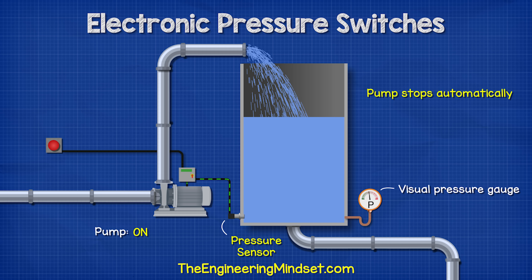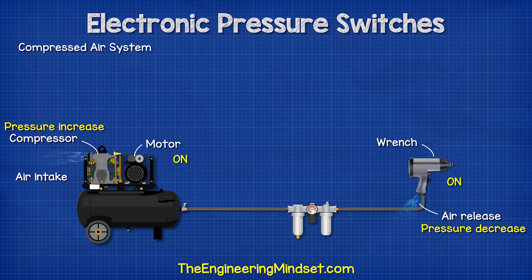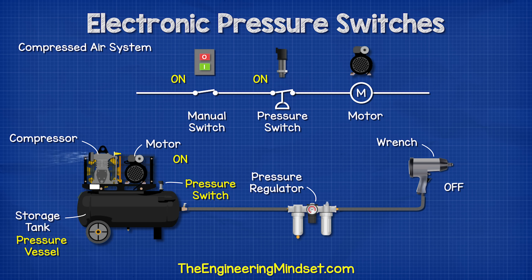We connect the pump to the pressure switch, and then when the desired pressure is reached, the switch automatically turns the pump off. If we think of a simple compressed air system, when the tool is used, air is suddenly leaving the system, so the pressure decreases. When the compressor starts, the pressure is suddenly increasing, so the system pressure is going to fluctuate. Therefore, we can use a storage tank and a regulator to temporarily store some compressed air and regulate its flow to smooth out the fluctuations and prevent the compressor from running continuously at maximum power.